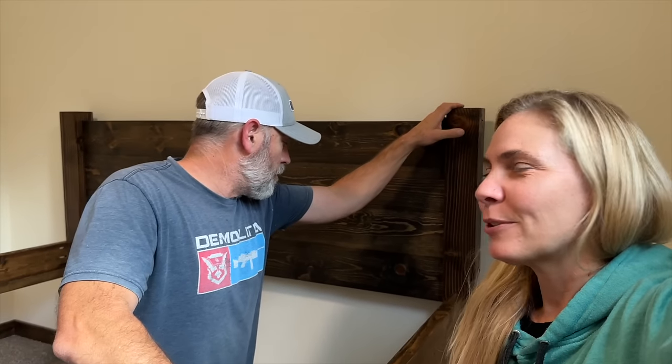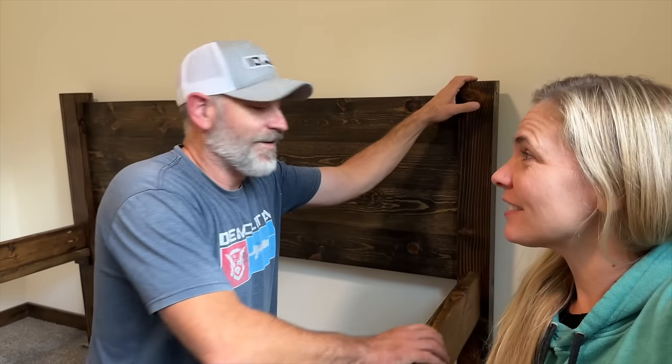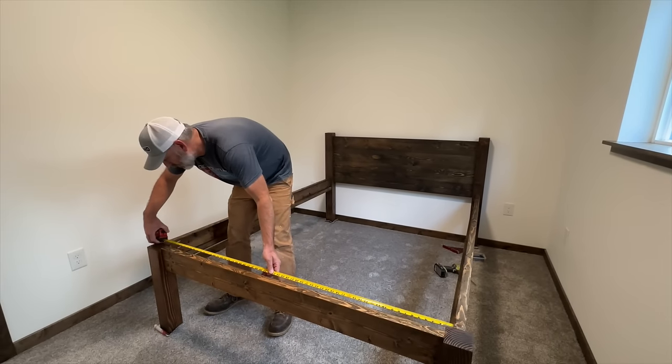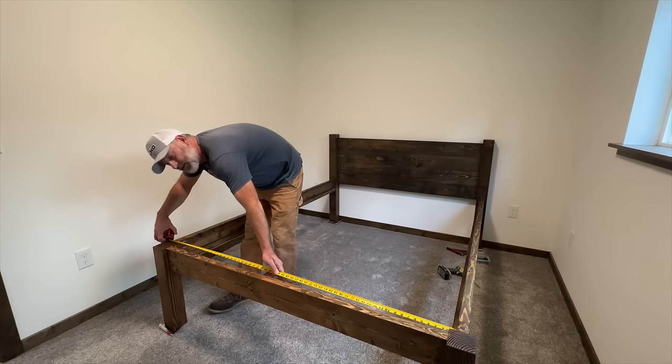When I told my mom we were making a bed frame, you know what she said? She said we're too young for such modern conveniences. We're going to cut all the slats that go in here to hold the mattress up in the middle — cutting them at 61 inches. We have half an inch extra on each side of the mattress, so 61 inches in between, because a queen size mattress is 60 inches.